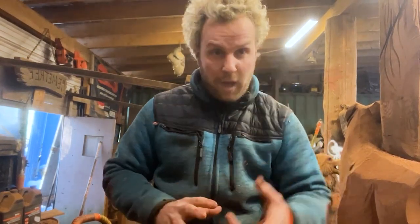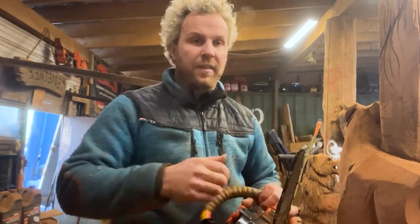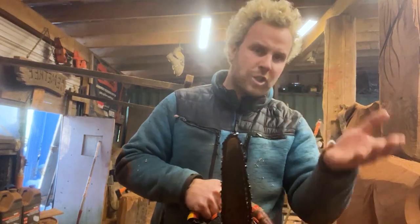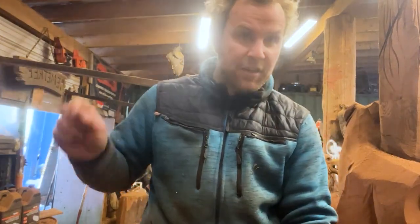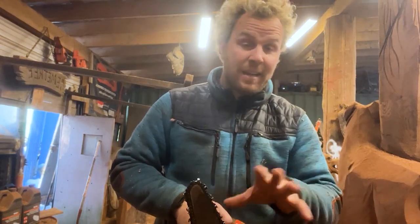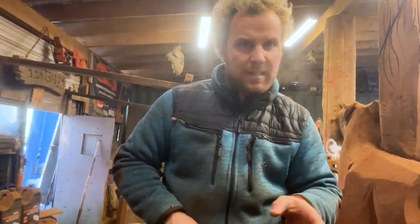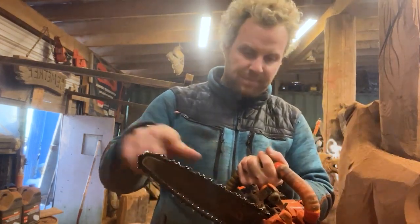And if you know how to use your saw, even if it doesn't mess up, there's times where you hit a nail and then all of a sudden when you're cutting, you can feel that bop, bop, bop, bop. It's a repetitious kind of thing, which means something's off in the tooth, you haven't sharpened it right. This happens the same way when you use the Makita finger sander to do what I just did. I definitely think if I was flat filing it and I had the patience to do it, 1, 2, 3, 4, 1, 2, 3, 4, it would be way more consistent and you wouldn't get that chatter.